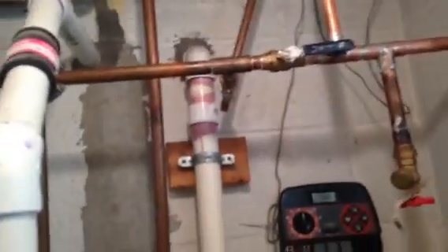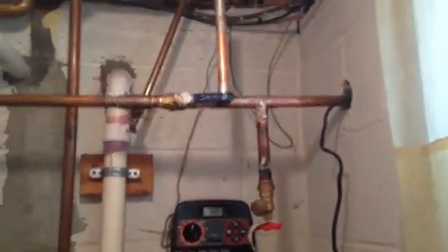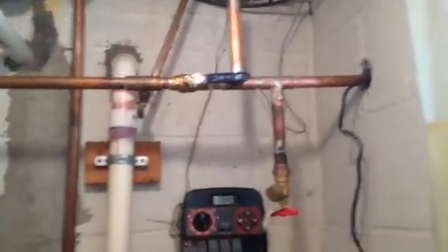I'm going to put some wall supports here because I think the water hammer is partly caused by the pipes shaking. I'm going to try to support these pipes a little better. I don't really see any copper touching copper to cause the noise, but who knows if all the pipes are secure within the walls — no way of finding that out at this point.